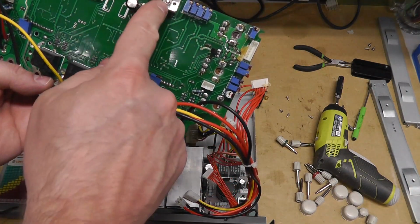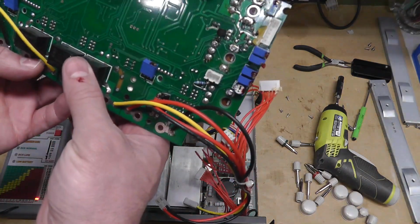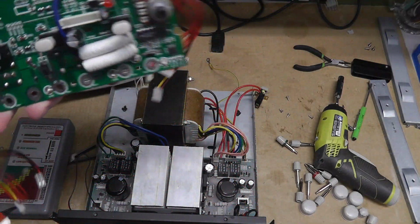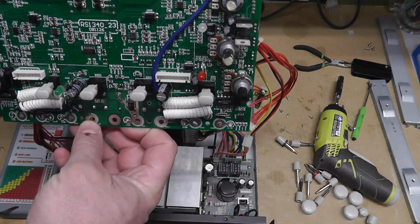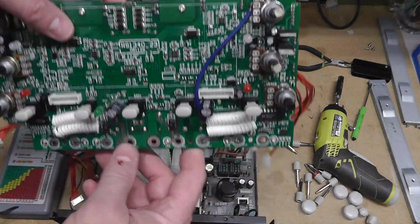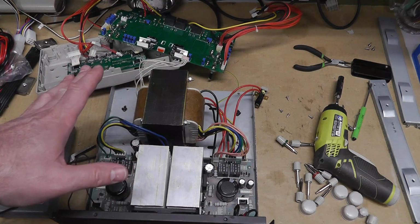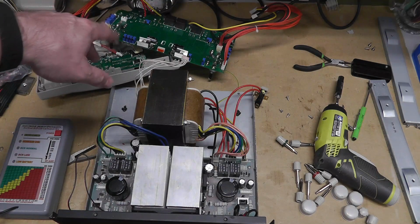And I don't know if that relay is powered by this, or maybe we weren't getting good voltages or whatever. I didn't do that test, but I'm going to replace this cap. Maybe we'll get lucky and that fixes our channel issue there. No, it's like this. That's on the left side. Yeah, I don't think that's going to fix that, but I'm still going to replace the cap. So let me do that, plug it back in, and see if we get better readings on our left side, because I cleaned out that button.